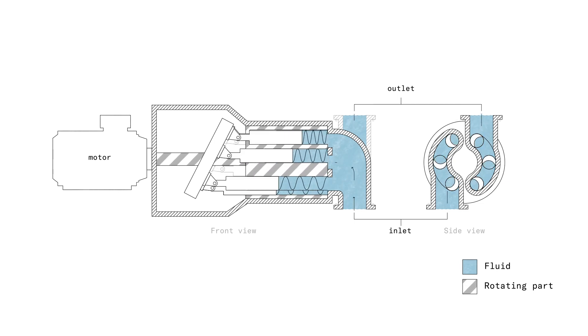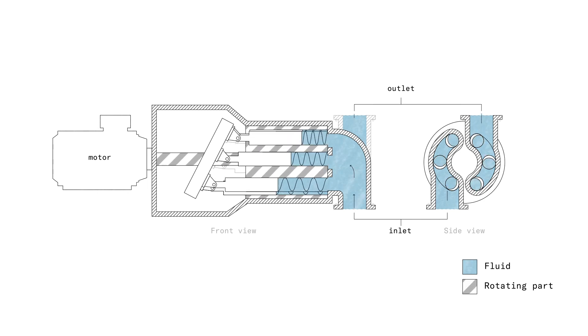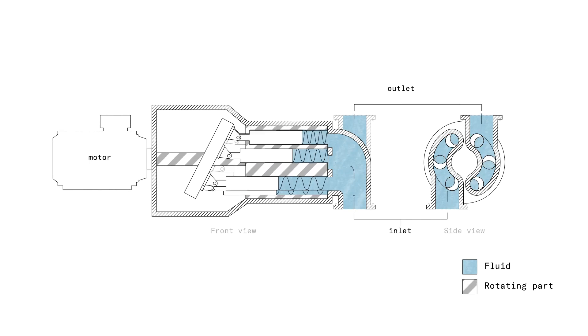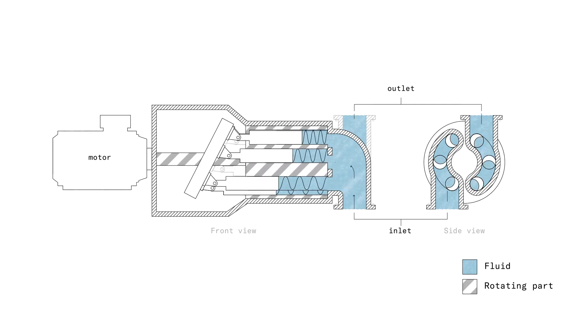For that we also need good inlet and discharge separation, which we can see on the side view. The side view shows two parts of the pump: inlet and discharge. On the left side, the liquid is being pulled in — that's where we do a volume increase. On the right side, the volume is being pushed away — that is the discharge, going from high volume to low volume, from low pressure to high pressure. That's how it works.